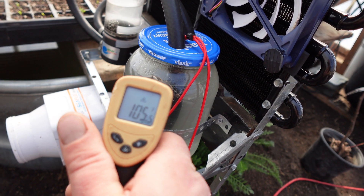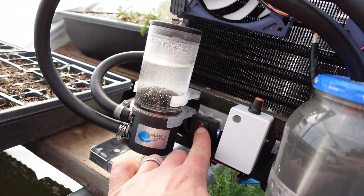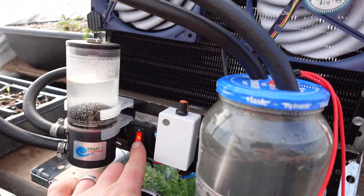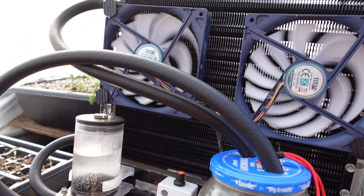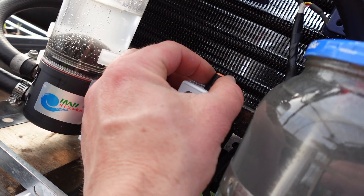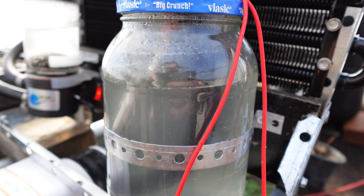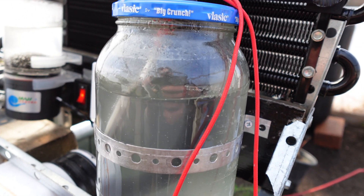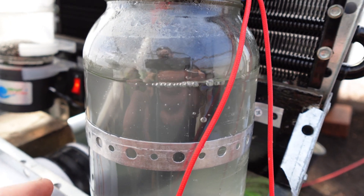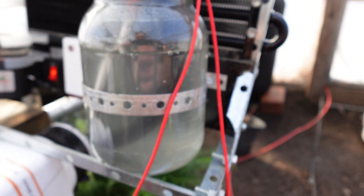We're sitting at about 105-108 degrees and it's not flowing yet. I turned everything up — that is our fan switch, so we are drawing through that radiator system with these fans. You can turn them on and off pretty simply. We've got our water pump which is controlled by this little motor speed controller, and once I click that on we've got hot air blowing out of these fans almost immediately. You can see bubbles forming in there on the heating element itself as it's creating heat.